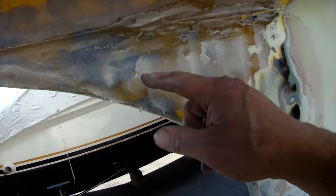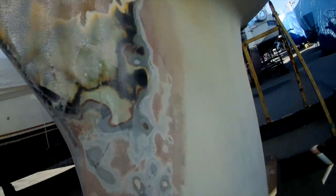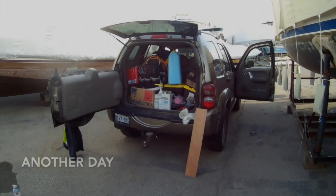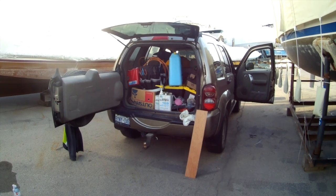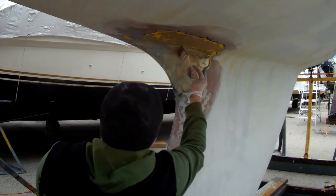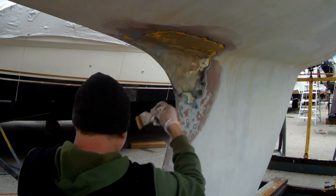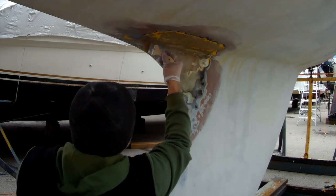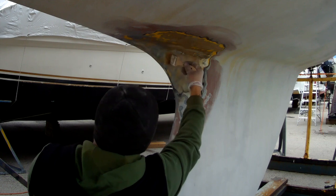No cracks. I'm going to lay out pieces here — another piece, another piece, another piece — to go over this whole exposed fiberglass all the way up to the top. I'm going to put four more layers and wrap them around the back. That's the traveling boat repair shop. I'm using West Systems epoxy — the 105 with the 205 hardener — mainly because it's end of March/beginning of April and still pretty cold out, but warm enough for the epoxy to set.